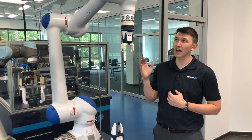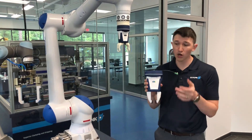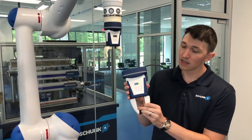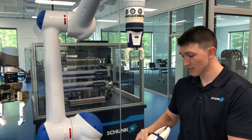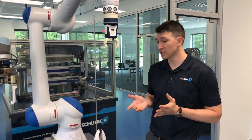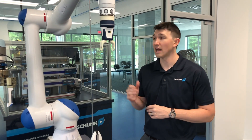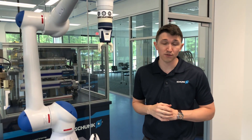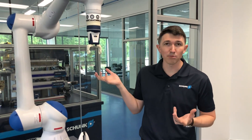It comes in four different sizes — we have one of our middle sizes on here right now. I'm going to pick up our largest size, so this is our Coact EGPC 64. It has 20 millimeters of overall stroke and quite a bit of grip force for a collaborative gripper. What's really cool about these is we do offer them in standard finger packages, and on this one right here, we've actually 3D printed those fingers. So if you have an application where you want to 3D print your fingers to be really custom to your part and get them done quick, you can do that. It's a great gripper for collaborative projects.